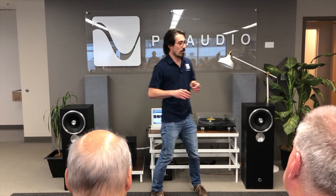And so I wanted to offer a Phono stage in that price range, in the Stellar price range, that offers that kind of resolution and sound quality. So I've decided to go with a fully discrete design that's going to be over 700 parts. We're going to have to match FETs. The input stage has 10 paralleled FETs for a very, very low noise, rivaling the best that's ever been.